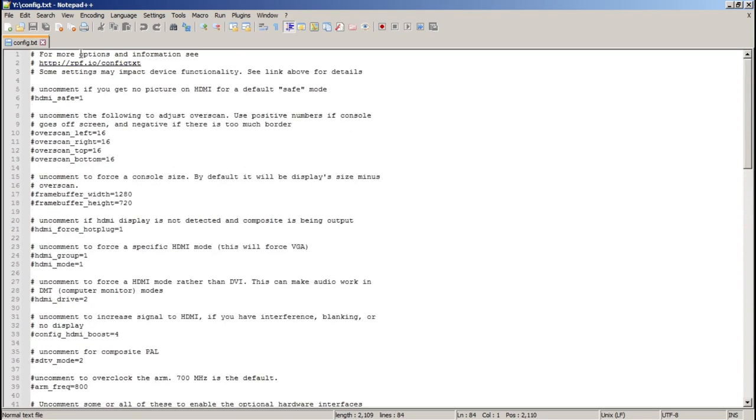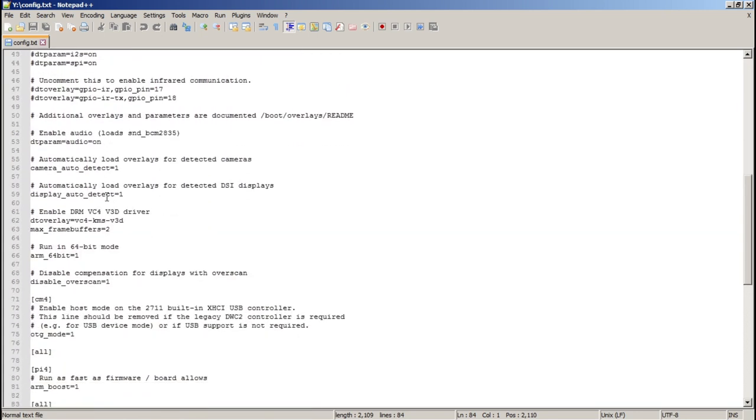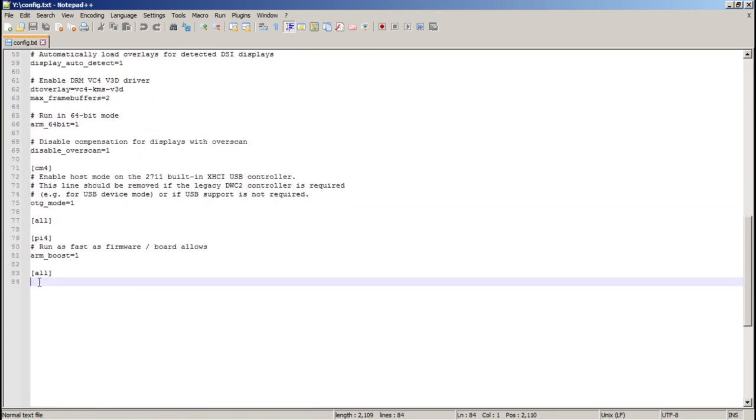Once it is open, we will simply scroll all the way to the bottom, and we will add the following code: program_usb_boot_mode=1. You will also find this code in the description.